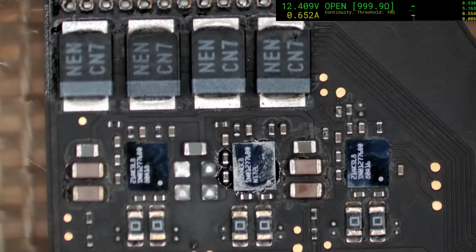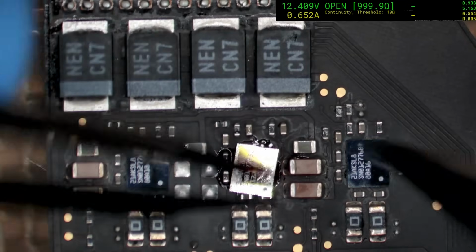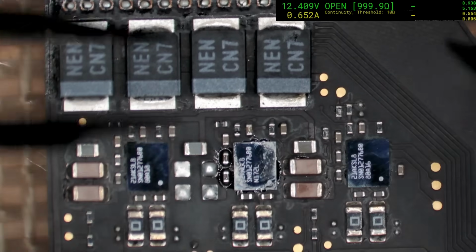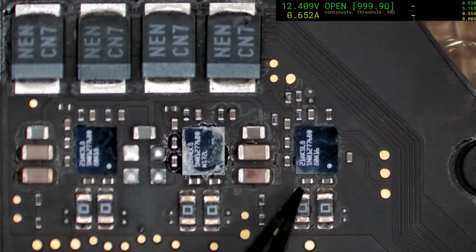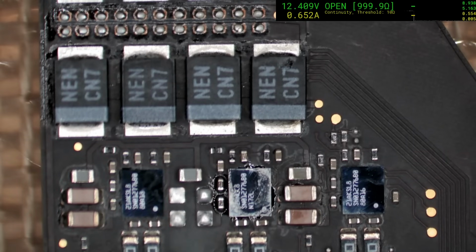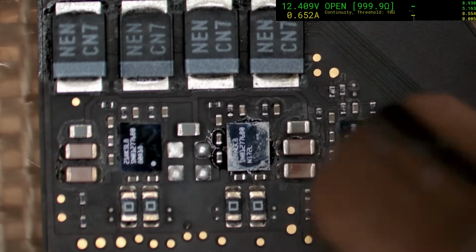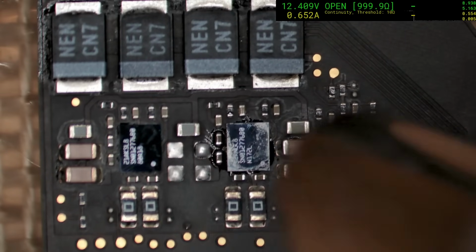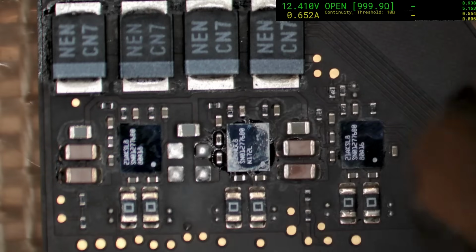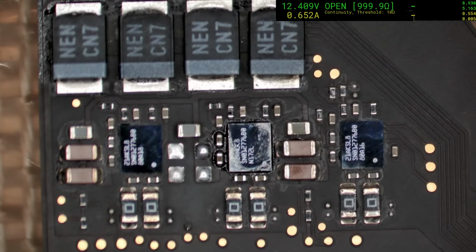Put the chip on where we think it should be. It's always a little bit unnerving doing this. You can often use the other chips as a guide for your distances, so like you can see the gap between those sides. You want to get about the same there, and then the balls themselves, when they reflow, will pull it into the correct position, you hope. Start heating it up from afar. The main worry here is that as it starts to move, it might catch. Okay, we're down already.